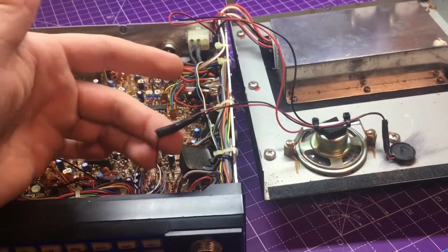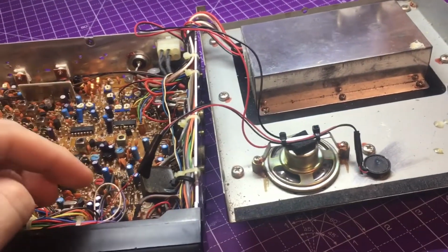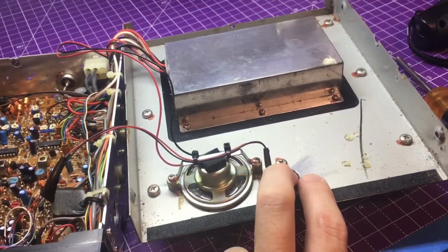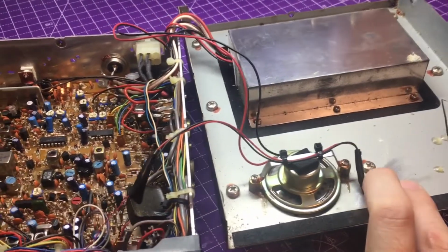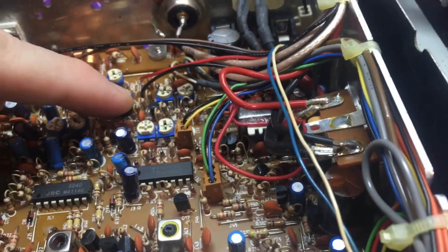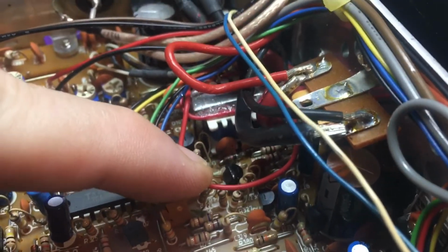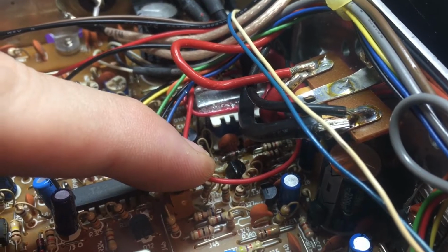First thing that stands out is the piezo that's been relocated, so he'd like to keep it like that. We're going to go ahead and run some good wires to it, do it all heat shrunk up. Light and switch for the amp power indication. And just going through normal mods as we do, we have our mod limiter there, and D78 at one point was desoldered for talkback, and of course that's been reestablished.